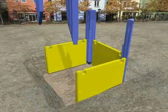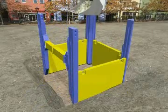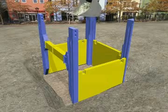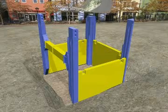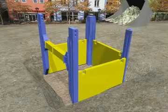Now the pre-installed slide rail shoring frame is threaded into the shoring plate guides. Through excavation and alternate pressing of the plates, rails and rolling struts, the shoring of the trench finally reaches the right depth.